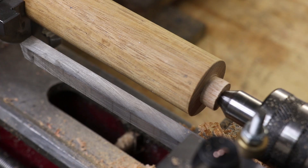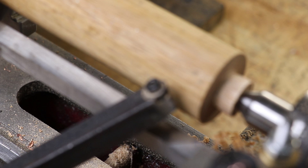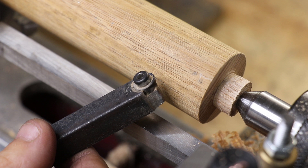I've never been that good at grinding woodturning tools from scratch, so I made a carbide tool using a button insert from a face mill. It looks similar enough to a carbide tool that I have used in the past, so hopefully this works just fine. And I didn't have a countersunk screw in the correct size, so I just used a cap head.